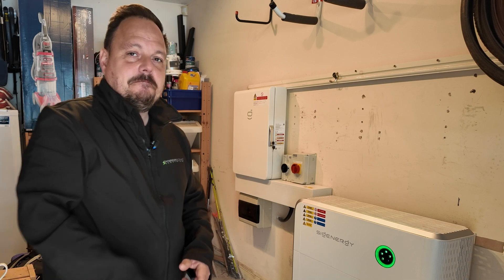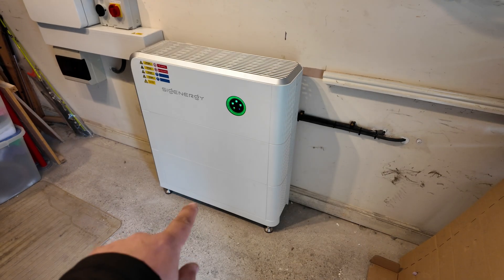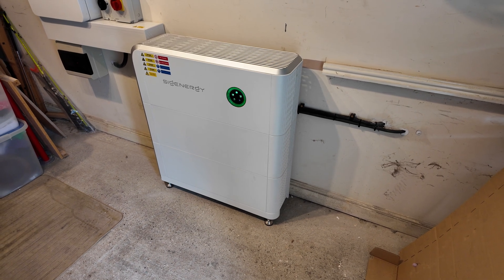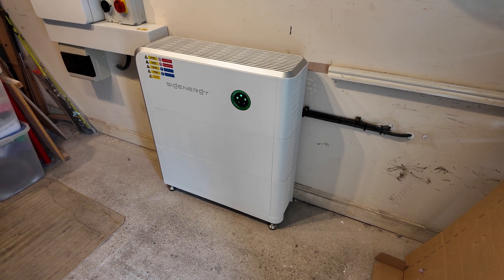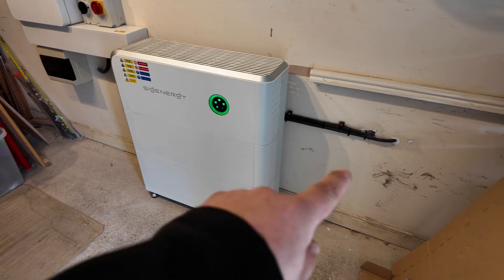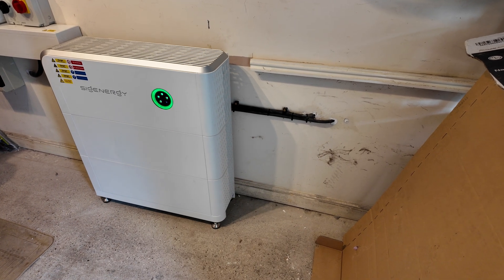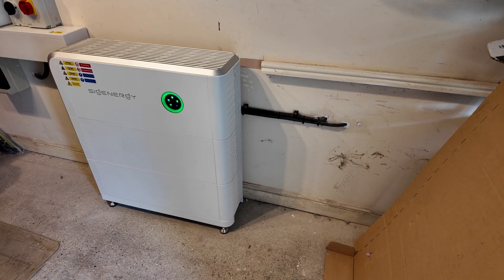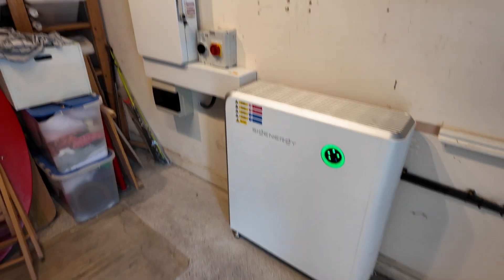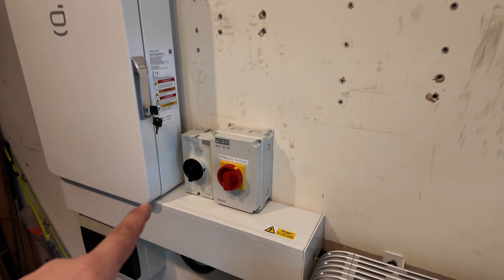You can see we've got our stack down here — this is a six kilowatt inverter with two eight kilowatt hour modules underneath it. We've got two PV strings running into this: one of three panels roughly pointing east and one of seven panels roughly pointing south. We've got our cables running in here for the EV charge point and the PV ultra, which takes two strings up to the roof with our Trina bifacial panels.